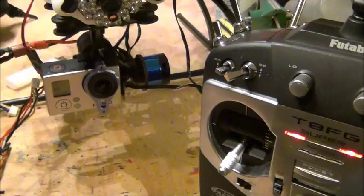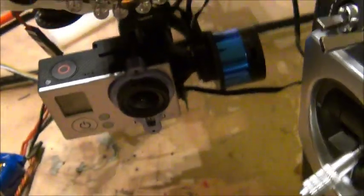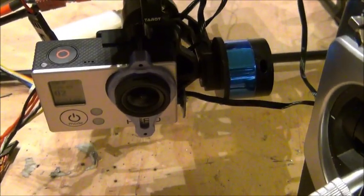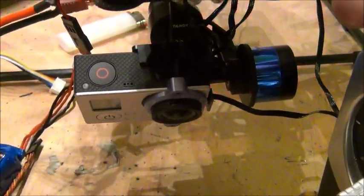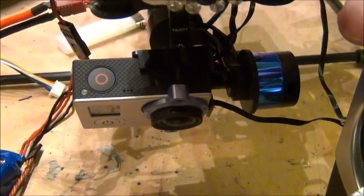What I did was hook up the tilt and roll — you can see I'm using the white and the red, both going into signal wires to my receiver on channels seven and eight. I unhooked the orientation control and I'm using the one-three cable plugged into the CTR line that splits off into three. There's my tilt slider, and here's my roll slider so I can compensate for variations in the angle of the pitch.